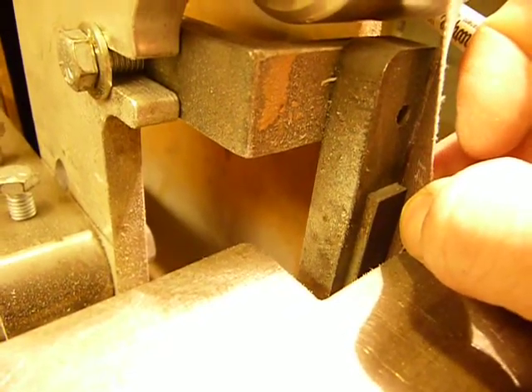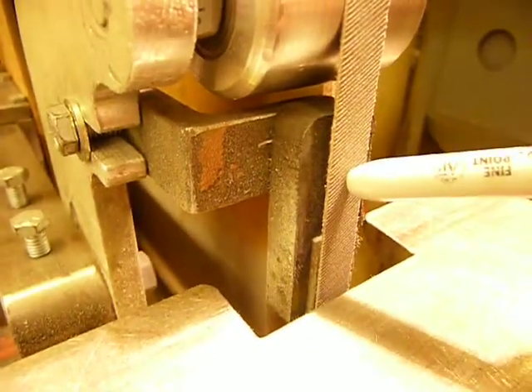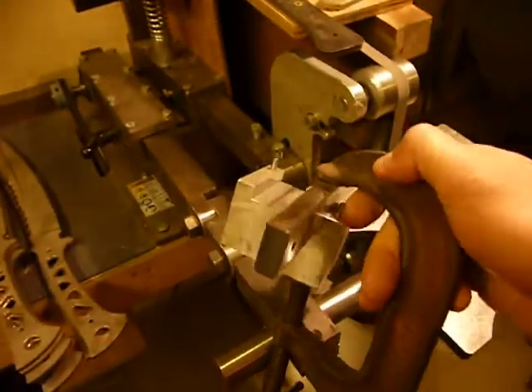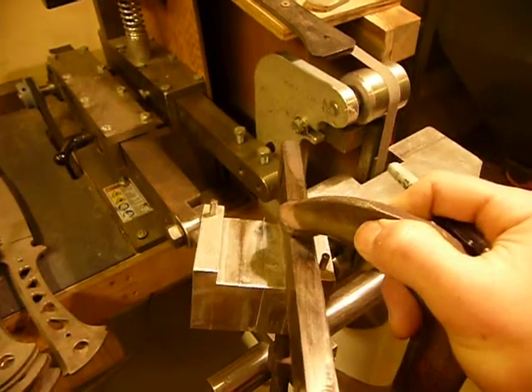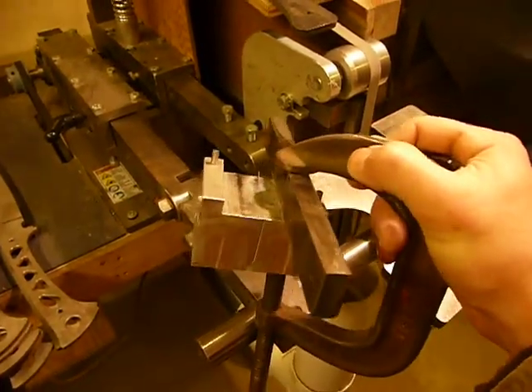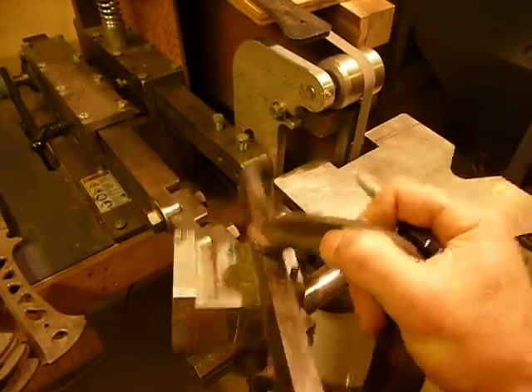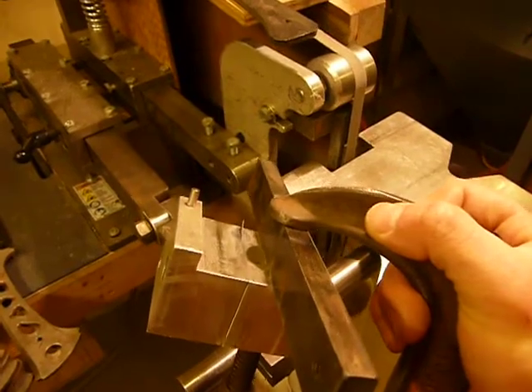That's just stick-on material. I cut my Norax belt in half and then in half again using my belt splitter from USA Knife Maker. This is a 2-inch to 1-inch belt splitter. Then I clamped on another piece of half-inch platen material. Now I've got a cutter that I can make half-inch belts with pretty well. It's not perfect, but it did the job on this one.